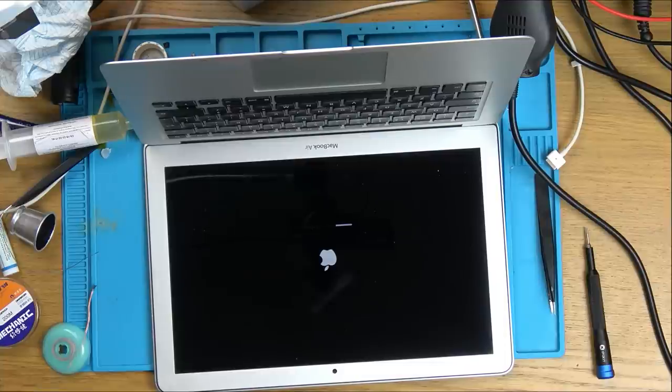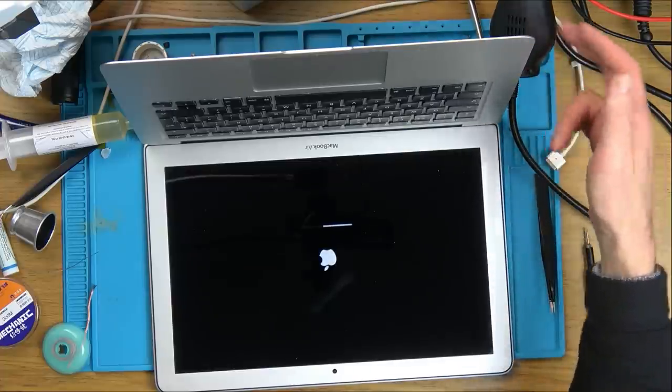They were numerous, weren't they? We had a blown backlight connector, a blown backlight cable going to the backlight. We had a blown backlight driver. We had a faulty keyboard connector. We had a faulty connector going from the MagSafe thing over into the board.